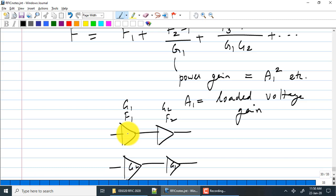Why do the intermediate impedances need to be matched? Good, very good question. If I have a discrete receiver that I am building, chances are very good that I am going to get two separate components and put them on a printed circuit board with some distance between them. Let us say you are operating at 2-3 gigahertz. The wavelength on the board may be 6-7 centimeters, depending on the mu r and epsilon r of the board material. The components themselves may be as large as a centimeter wide. You may need 1 centimeter between them to make sure you can reliably solder and connect them together.